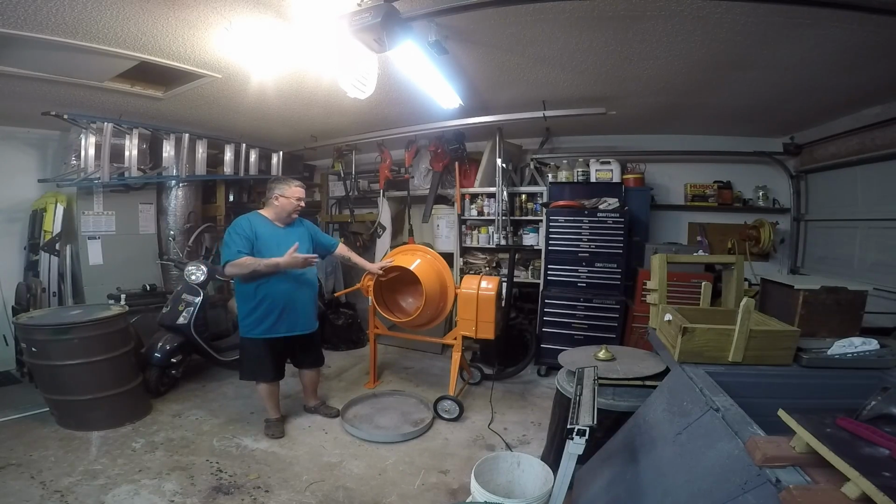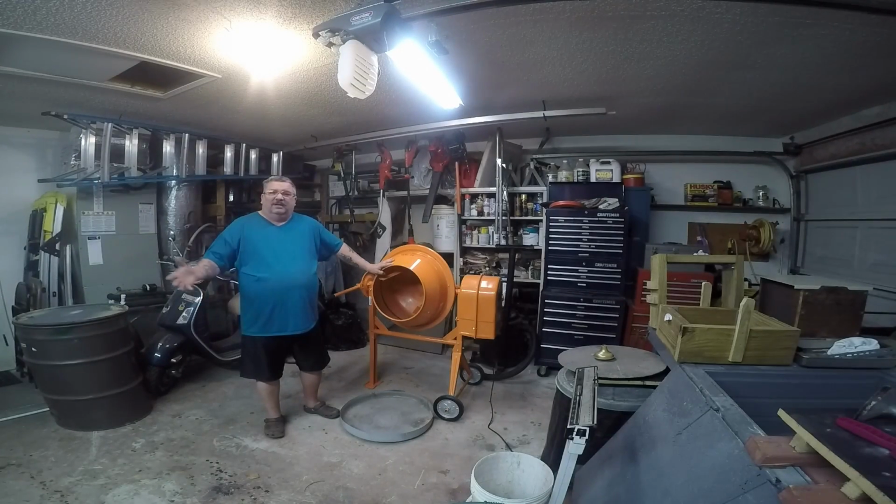And then after the mixture is put together, you add 3 pounds of water in this formula, and you mix it for 5 minutes dry. Then put the water in. You try to sprinkle the water in. You don't try to put it all in one blast, because you want to spread it out as much as possible so it mixes as quickly as possible. If you just had a big glob of sand and clay bunched together surrounded by dry sand, it's going to take a while to bust up and redistribute.